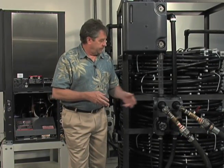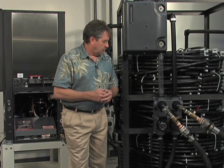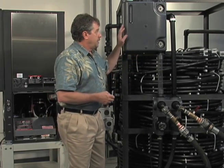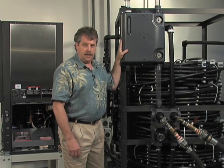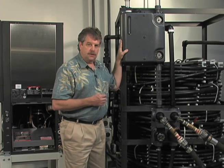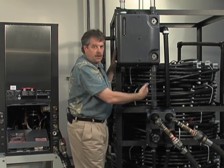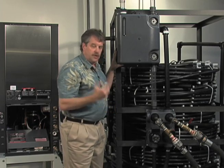Now that we've got our hoses connected and double-checked all of our connections, it's time to roll our internal three-way valves so that we will initially be flushing the loop only. Here we have what's called our GeoPrime tank — this can be a semi-pressure or a pressureless tank, but that will be a separate video segment. For this flushing video, we're going to have these three-way valves oriented so that we're going straight by the tank — not flushing through the tank, but going straight through into the flow controller as if it didn't really exist.